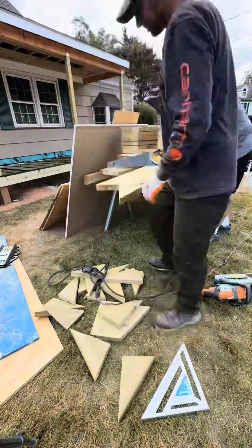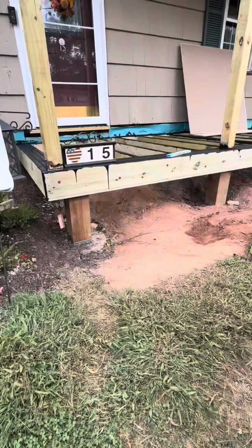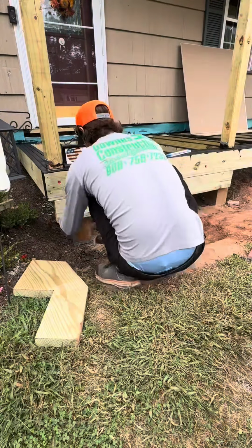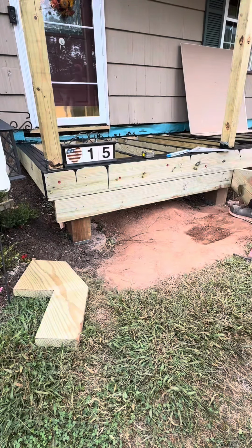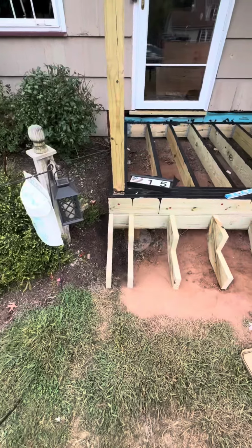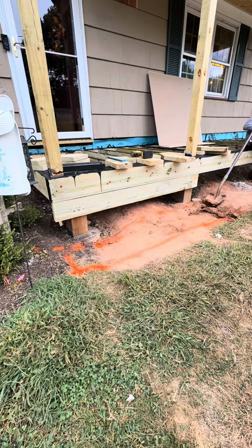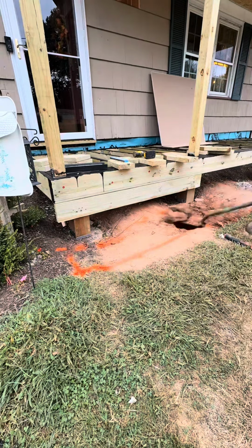12-inch wide, that is. Now the bottom, you have to cut a little bit less. So if it's 6 3/4 and you're using inch decking, you cut it at 6 or slightly under 6 so that each step is the same in height. Now we're fastening our ledger board. It's just another board below the deck, so we have more to adhere to with what will be our stringer hangers.